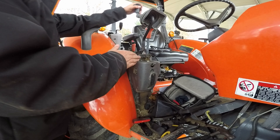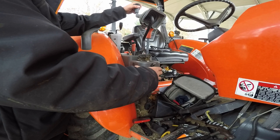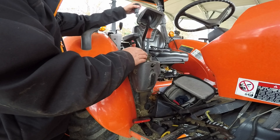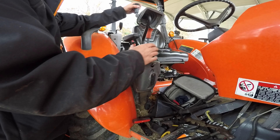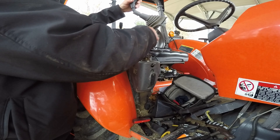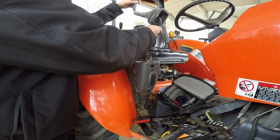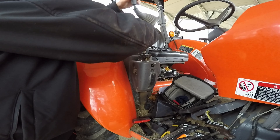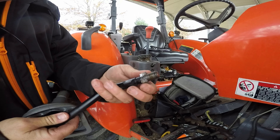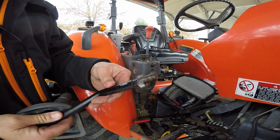The problem is you can't just put it on the nut and try to break the nut loose because you've got all this assembly attached to the tractor. You have to make sure you hold onto both pieces to make sure you don't bend or break anything. That nut was just way, way too tight. But now that it's loose, we can just thread our control lever out of here. It looks like I didn't even touch the threads on the lever and they're in really good shape, so I could reuse that if I need to.